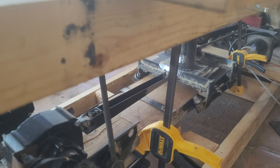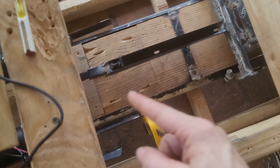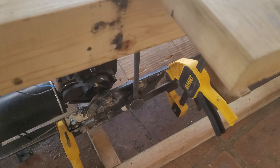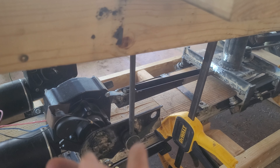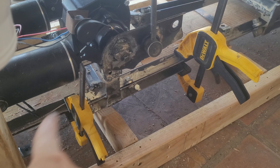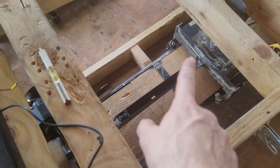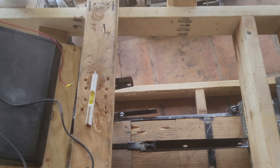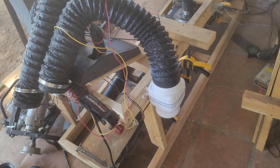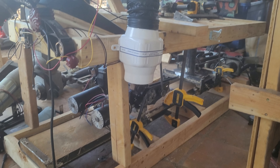Right now what I'm doing is I'm going to weld the piece of metal that's going to connect the rear trolley to the front trolley, because otherwise with the connecting rods on, if there's any sort of weight on there, that trolley just shoots out. So I have clamps on there to hold the trolley in place, then I've got to grind that out a little bit and weld it on so it'll hold the front and rear trolley stationary so I can slide it back and forth.